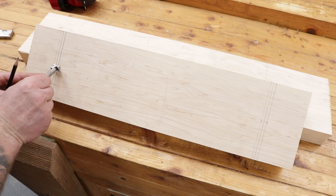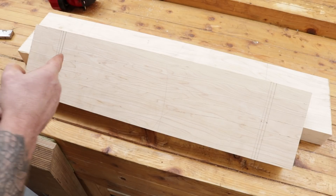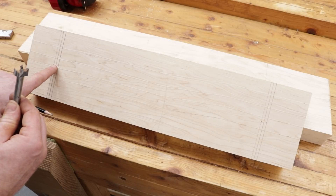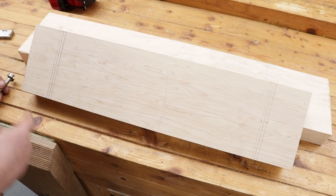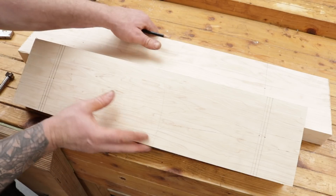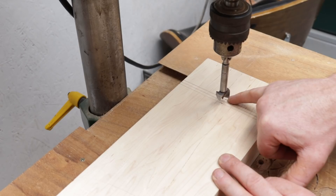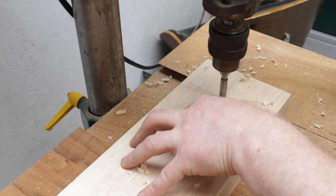I have a 20mm bit and the threads are 20mm in width. I'm going to drill one hole here and one hole there — five millimeters offset from center either side — then join those holes up to make an oval shaped hole in the front. That way the screw can move left or right, which means I can tilt the jaws of the Moxon vise to clamp wedge-shaped or tapered pieces of timber. Let's take this to the pillar drill and do that now.